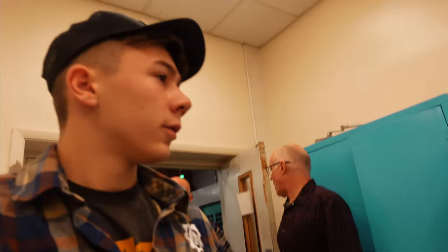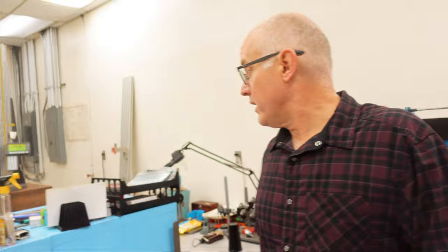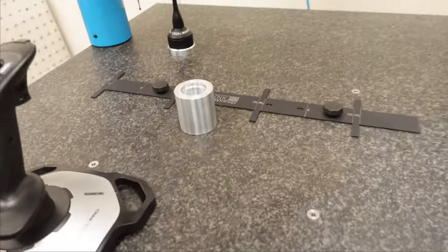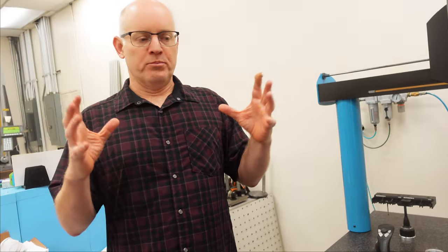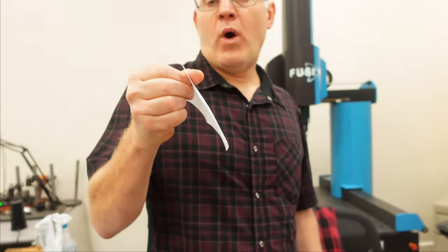This is our quality control department. You can use this joystick to jog the probe around and it'll probe the internals of a shell. You can move in there and use this probe to make hundreds of probe points on a cylinder — basically making sure your cylinder bore where the bearings are pressed in is really accurate. No cylinder is perfect, so this thing probes all around it. The computer calculates the best-fit theoretically perfect cylinder that fits all those points, then looks at every point that is outside that perfect cylinder. That's how you determine how much it's out of tolerance — measuring discrepancies that may be a 20th of a sheet of paper.